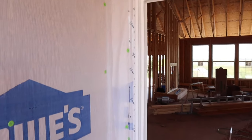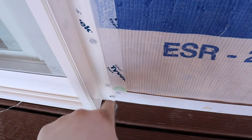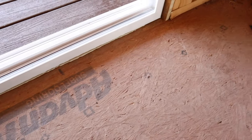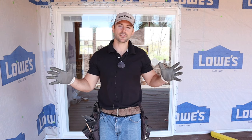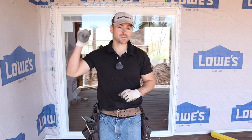That is what the outside is going to look like completed — you've got your tape around the edges, nail holes, the lip, and everything is covered up and looks nice. Now if water gets behind here it goes behind this flashing and down to the ground. You can also run a bead of caulk there if you don't want any water pushing back under it. The liquid nails seeped out some, which is fine because we know we've got plenty in there — just scrape that out before it sets up. The inside is complete and the door install is done. Thanks a lot for watching, be sure to subscribe, smash that like button if you found value in this video, and I'll see you in the next one.